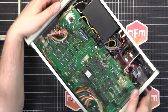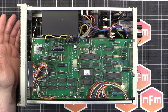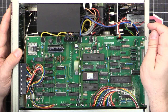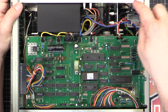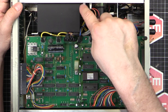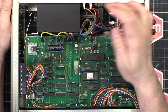But if you can find an older manual for an older unit, they do make some very good equipment. So this is the top of the unit - we've got a line input filter, it's a TDK which is good. The old Schaffners tend to go up in smoke but the TDKs are very good - Japanese brand of course, because it's a Japanese made unit. We've got a line fuse, a bulk filter capacitor, a bridge rectifier, and some ceramic standoffs. Now these you've got to be careful with.